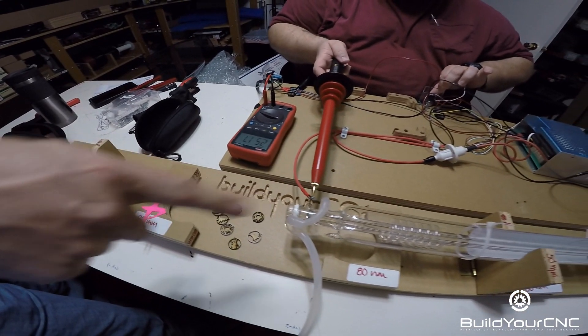You don't actually want to put your finger anywhere near the high-tension lead because there is a dielectric coefficient for air — 10,000 volts will jump across a small amount of air, and if you get too close and you're the closest circuit to ground, it will jump across and bite you. Richard actually shocked himself this morning.